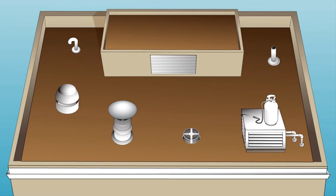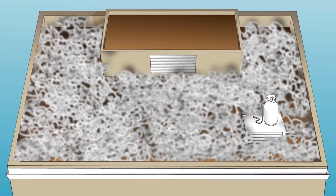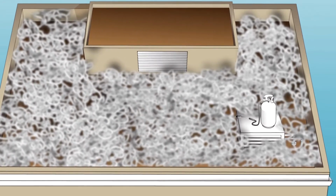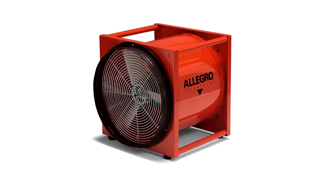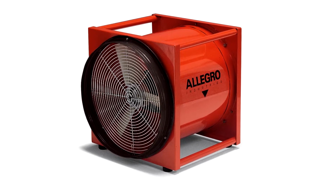Propane gas is heavier than air, so it can collect or pool in low or poorly ventilated areas. Combustion gases from a torch can also collect in confined areas. Inspect the work area for locations that may be a problem in this regard. You may need to set up special explosion-proof fans designed for hazardous locations in these areas to properly ventilate them